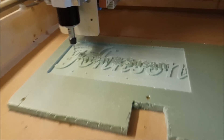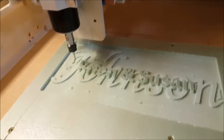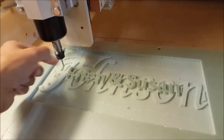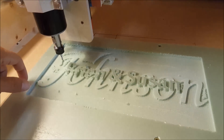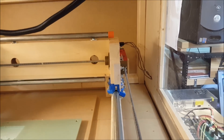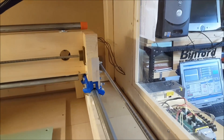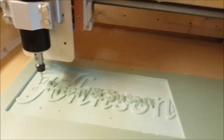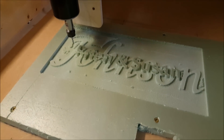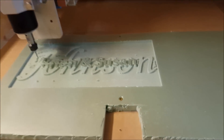The technique itself works fine — it is possible to do stacked text with free software. The issue I had here was that getting close to the end, the cutter came across and on the back stepper the Acme rod with the pineapple coupler — that 3D printed coupler — came out. So that side was loose and then the other side started to let go too. Those couplers need to be revisited and made stronger. But as far as the technique with Inkscape, JS cut, and free software — it can be done.